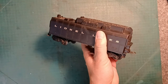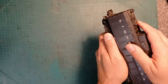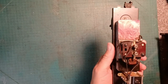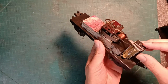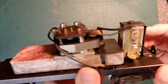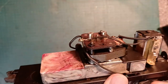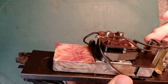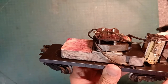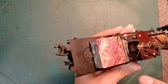I like to do a little internal check first before I throw them straight onto the track, because I don't want things to short out. I don't want to wreck my transformers or anything like that. So right away it's looking good — the solder joints look nice, they're clean. This relay looks a little bit bent, but that's not a big deal. These solder joints up here look great.